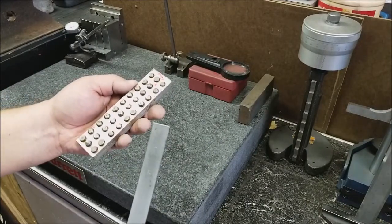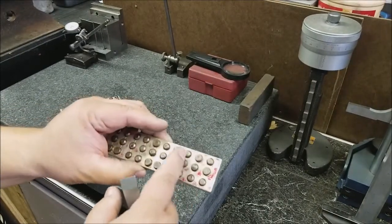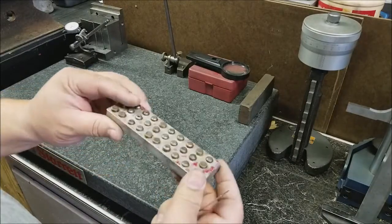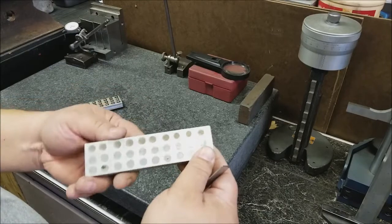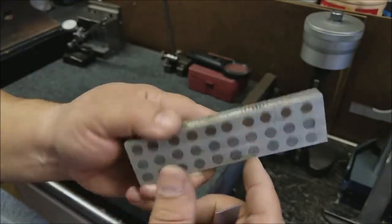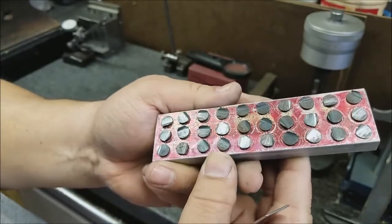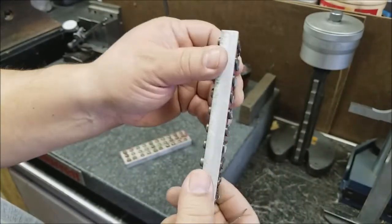What I did in the shop — the job shop — and a lot of guys did these, you've probably seen them around. You just take and you drill and ream a bunch of holes. Then I used a one-thou under reamer and pounded these dowels in. The dowels, obviously, are still proud of the surface even with the smallest ones available. This side has started grinding where all the dowels are at least flush. Here's one where you can still see the dowels are freshly cut off. This was many years ago and I never really had a need for them — I wasn't allowed to use them in the shop where I apprenticed.